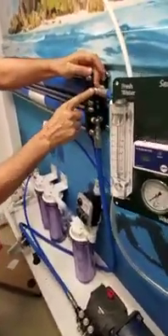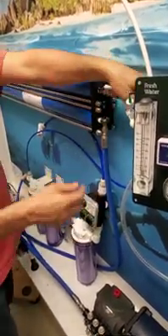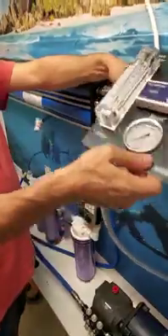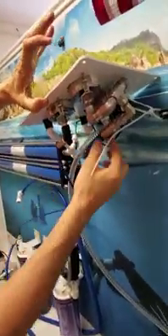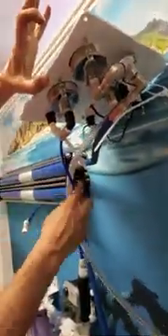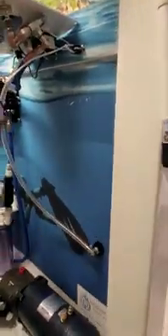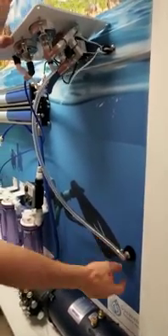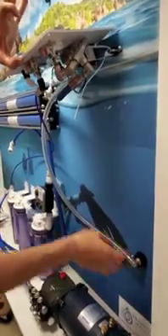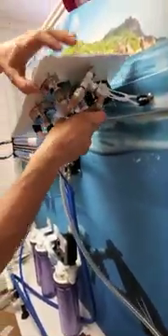If you have one membrane, the brine water comes out of the port closer to the outside, and from the center port we get the fresh water. The brine water goes into the panel and connects right behind the pressure regulator. From the pressure regulator, we go with the spiral steel-reinforced PVC hose overboard — that line is included, about six feet — with a 90 degree stainless elbow to the overboard, which is a low profile overboard.